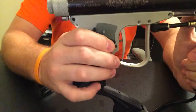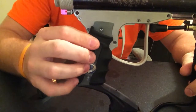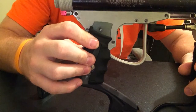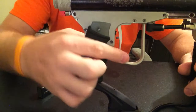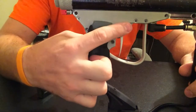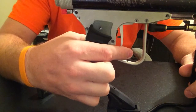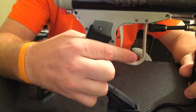The grip frame I also designed and had machined by a friend in Sweden. I designed the grip frame and the trigger as well, and he did all the machining work. The trigger has a magnet here with a set screw above to change the force that the magnet has in pulling it.